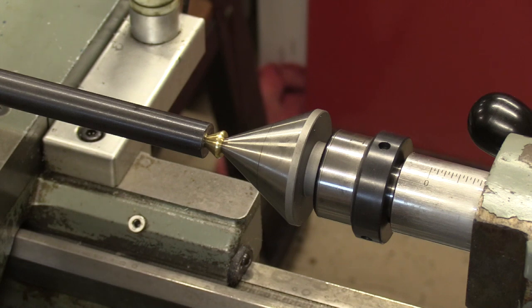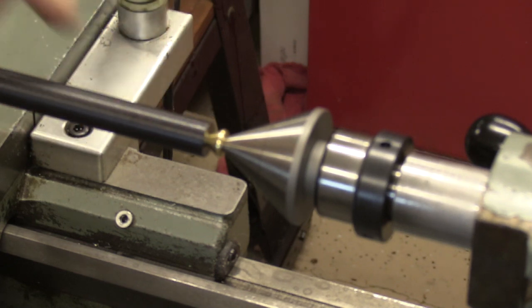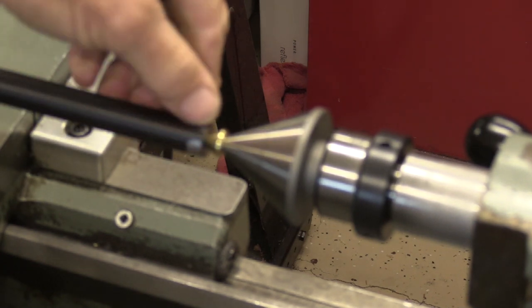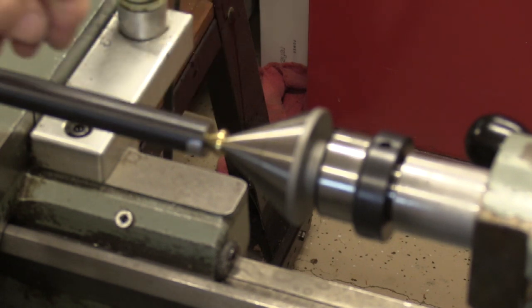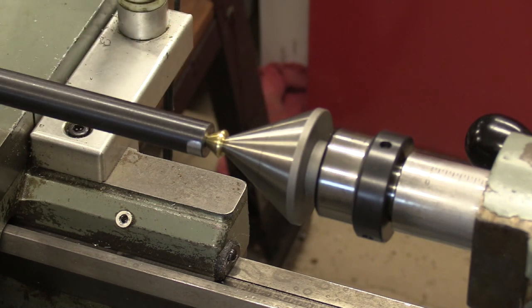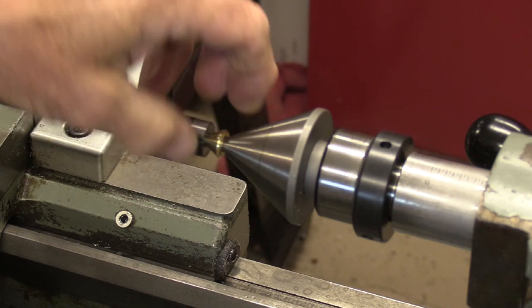This is why we're turning this down just a little bit, and this is practice at this point — we haven't cut the barrel yet. We did turn it down and taken a skim cut of about ten thousandths. You can see we cleaned this area but we didn't touch the rest of it, which tells me that the bore is slightly out of concentricity. So we need to take a little bit more until we get the barrel outside truly concentric with the bore.